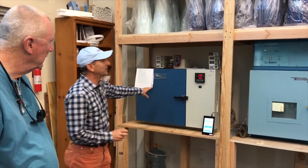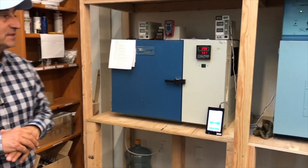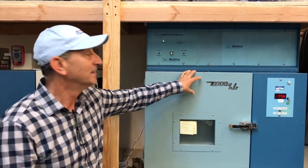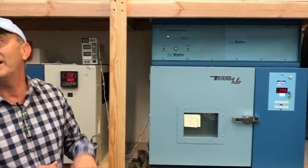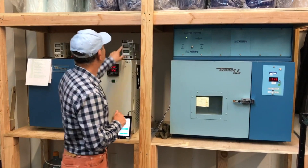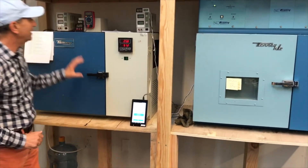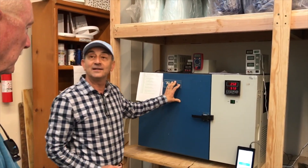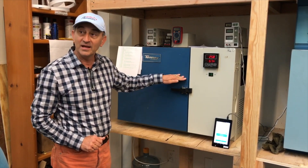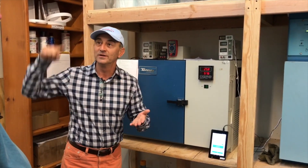The next thing I would like to show you is our chambers. We are testing the product in two chambers. The most difficult scenario for the product is high heat and high humidity. In this chamber we have two products running at 75 degrees C — which is 165 Fahrenheit — with a humidity level of 95-99%. We are running two units here and monitoring them continuously. And here we're running two units in an endless loop of temperature cycles, starting at minus 25 C — which is minus 13 Fahrenheit — and going all the way to 75 degrees C, in a continuous loop, testing that the products are not breaking.